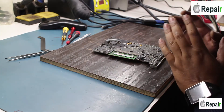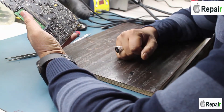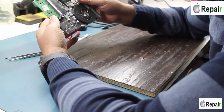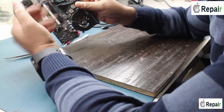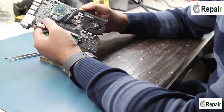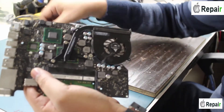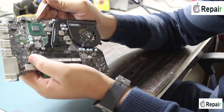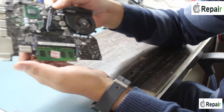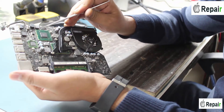Someone has already done the BIOS, someone has changed the charging IC, and also the core IC has been replaced. The charging FET has been replaced. So many chips have already been changed. The clock IC has also been changed — I received this motherboard from the local market and someone changed the clock IC.